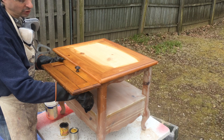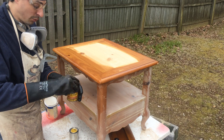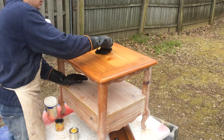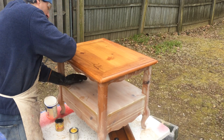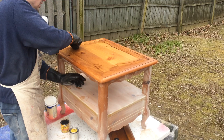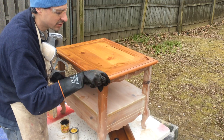I don't know if you can see it, but that's pretty close — not too bad. It looks a little more yellow on the edges as it's drying, but it's pretty close. I'm probably not going to need to mix the two. When I did the other table, I put down the Golden Oak and the other one on top, but most of that already absorbed into this rag so it may have already mixed. Love saving a step! A little bit goes a really long way. Brand new wood is a little more thirsty and will suck up more stain, but refinished pieces usually don't absorb as much.